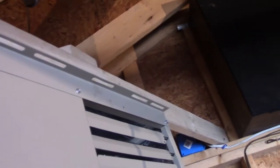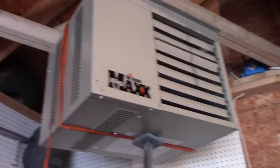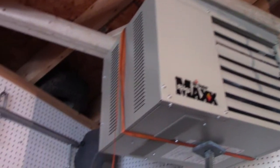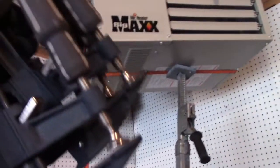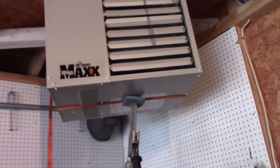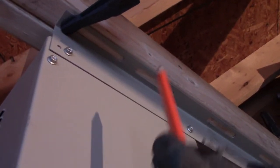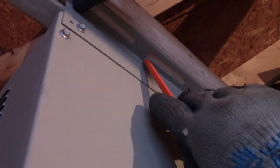It's easy enough to fix — just costs more wood money. That was a $16 mistake, but the good news is now it's more durable and rigid. I left it in place, put the boards on there, clamped the edges, and straightened things out. I'll drill pilot holes for some lag bolts. Because of the way I'm doing it, I can't easily get a drill in here, so I'll mark the holes, loosen the clamps, slide it over, drill the holes, and do the same on the other side.